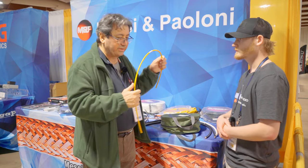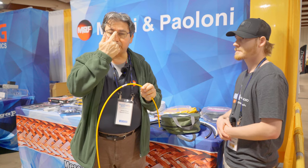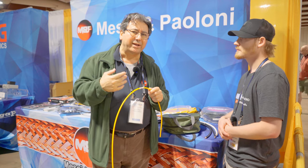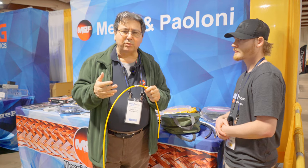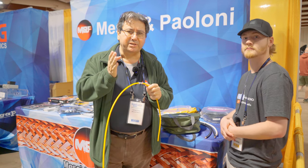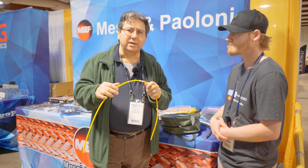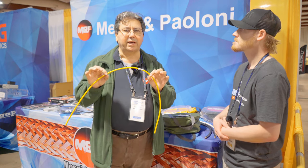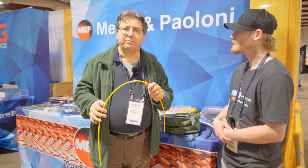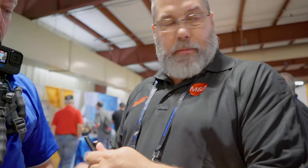As you can see, the cable is bright yellow. It's a very sturdy cable that has been tested for 100 operations of unwinding and rewinding, tested every 20 operations, and after 100 operations it was still perfect. This was specifically made for portable operators. It's a triple shield — two braids in copper-clad aluminum — to keep it light, while still being very flexible, sturdy, and durable. You can even trample on the cable with no problem.